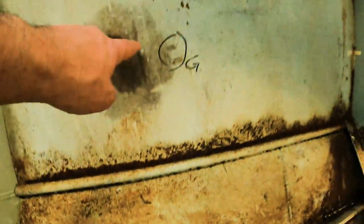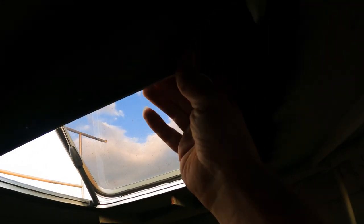A lot of work to do along the floor. Basically uniformly it's everywhere, even on the floor. What it looks like in some spots is a lug has been welded on and they've used it - maybe with a block tackle or to lift the plates up into position - and then once welded they knocked the lug off. Or they could have used a chain block to pull the sheets into shape. I love the laser-cut profile on these - you can see how close that fits. It's going to give a beautiful seal. There's a bit of work to do in here but we've got to start somewhere.